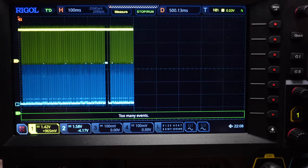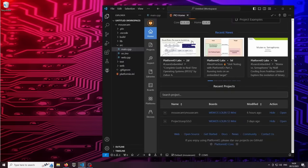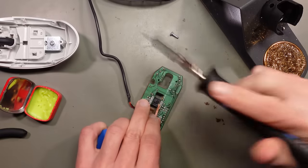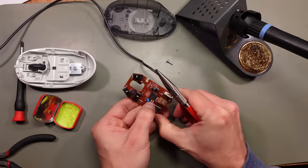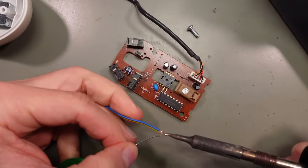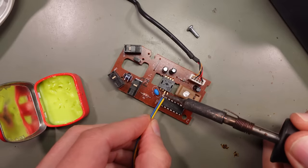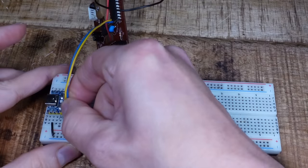However, the ESP32 does not feature this natively, so I needed to implement it in software. I was using Microsoft VS Code with the Platform IO extension for programming. But before I could start, I needed to gain access to the clock and data pins. So I removed the solder from the soldering joints with some desoldering wire, then pulled them out with pliers. Wires and pliers rhyme — a cute little poem to keep you engaged while watching me solder. I joined the other end of these wires directly to two IO pins of the ESP32 mini board.